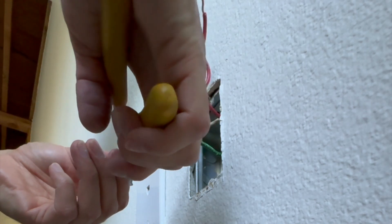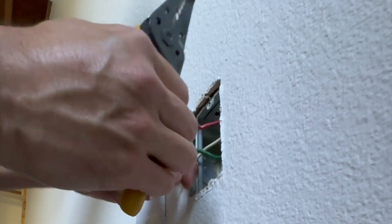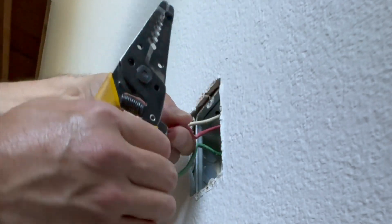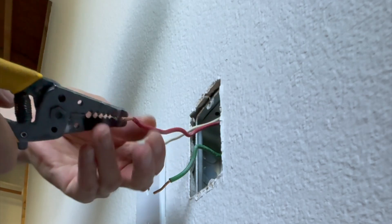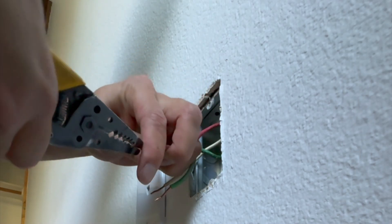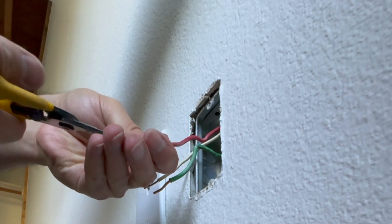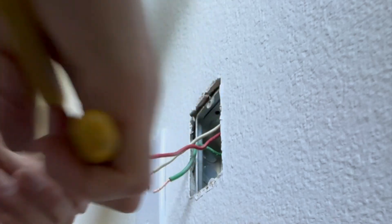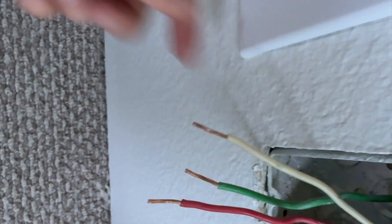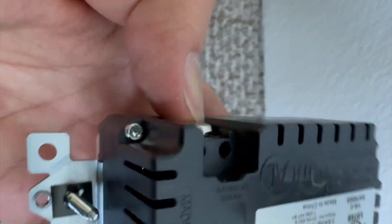I just don't want to shorten these existing wires since they're already short, so I'm going to straighten the already-stripped section and then cut off just a little bit because I don't want them too long either — you only need just enough to insert under the washer, and you don't want that stripped section of wire sticking out of the electrical box.